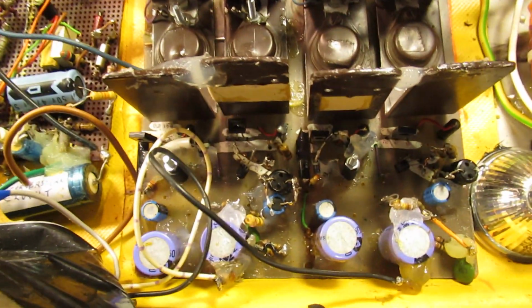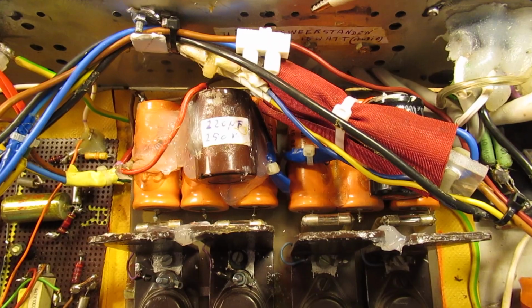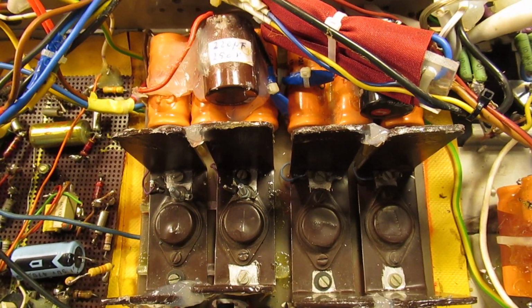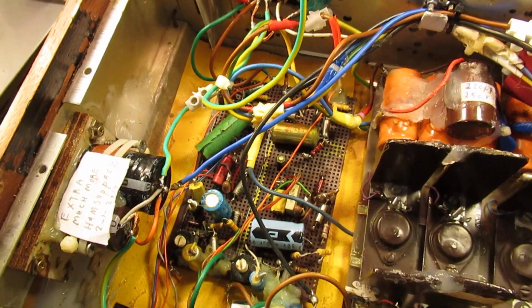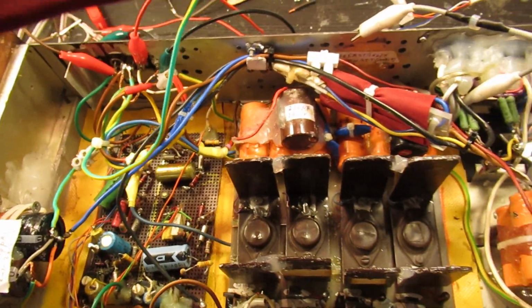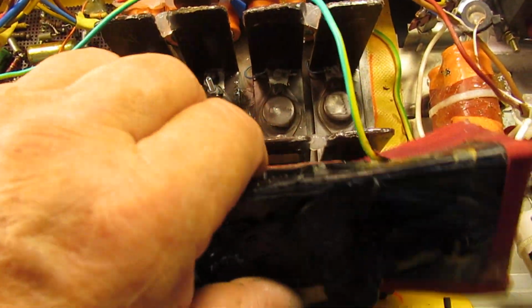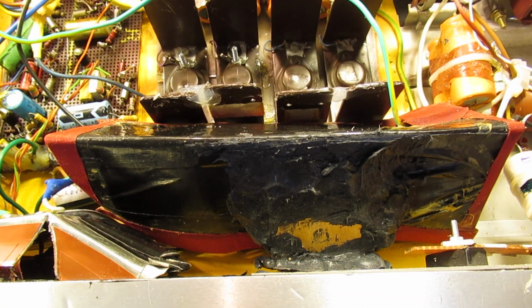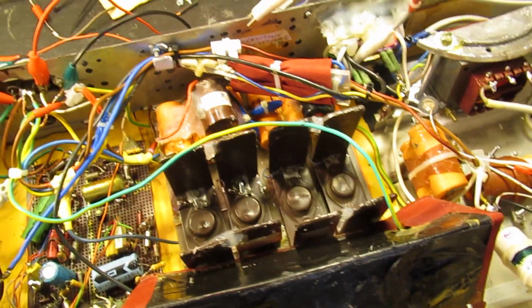And that's very important. Hum is always, say, very irritating. When you have a good amplifier, there must be no hum, absolutely no hum. So one point earth and one point shielding, that's important. There are many videos on my YouTube channel about that issue. And this is the hood that covers the input and shields it from hum. Well, that was all.